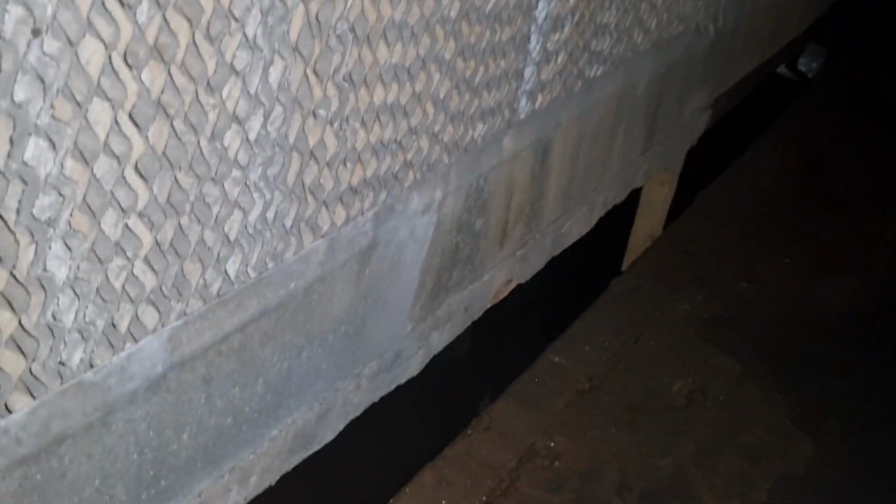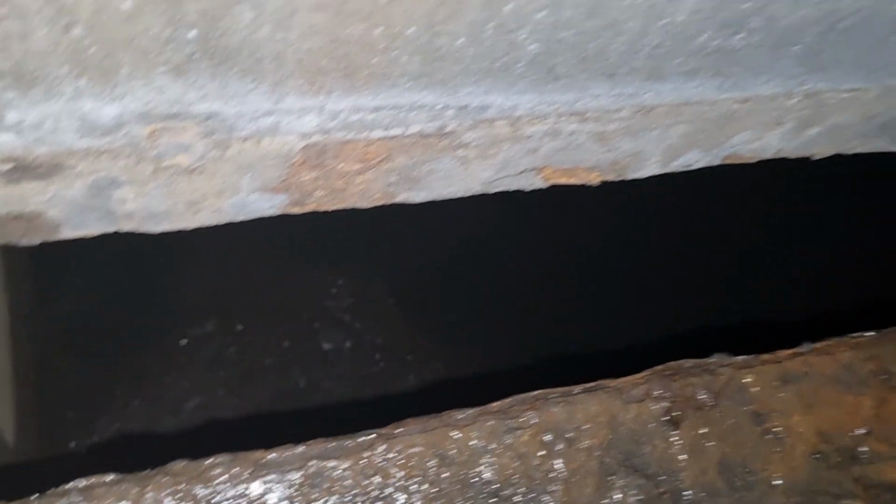So we have these air filters, the pre-air filters. After these air filters, air passes through the cooling pads. These are the cooling pads, as you can see, from top up to the end, and below is a sump tray, the water sump. All the water circulates from the sump to the sprinkler.